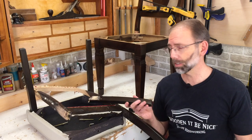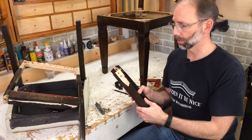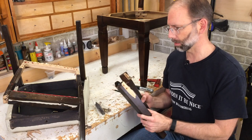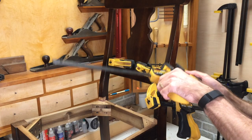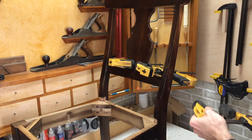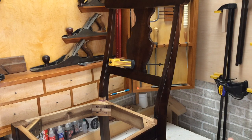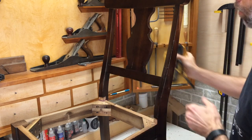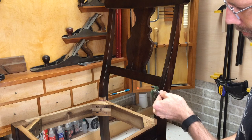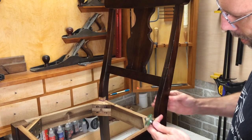The right spot for this furniture is the landfill. Another piece of furniture got dropped off while filming and insert nuts are pulling this wood apart — another puzzling break. I think I might be able to glue it back together. But first, let's get back to the first chair and take the clamps off. It's important when you glue things up that you not only let the glue dry but let it cure as well. With the epoxy I use it can be one to three days; with PVA it's usually 24 hours. Check your glue bottles because there is a difference between dry time and cure time. The next step is to take a slot cutter and cut a slot in here — I'll mount it in the router. This has a bearing guide that will allow me to get a slot in there so I can insert a spline and reinforce that break.